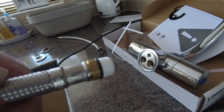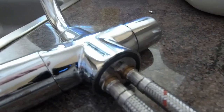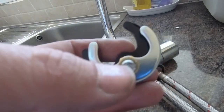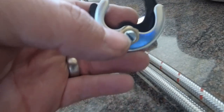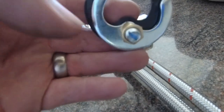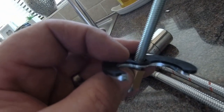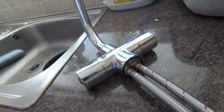The pipes are in, just snugged up with an adjustable spanner, and make sure you get that o-ring in — that's very important. The last bit is this plate. You'll notice on the plate there is a flat-bottom screw hole just there, and that's for locating it into that hole to get some purchase on it without damaging the threads. Always remember to put your rubber seal on there as well because that's what holds it nice and tight. Now just plonk it through the hole and plumb it all up — easy as that.